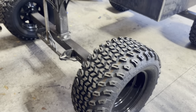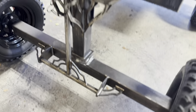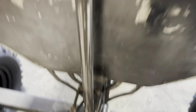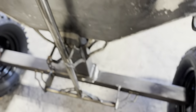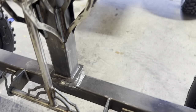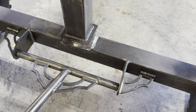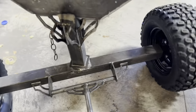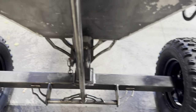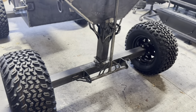Let's take a look at the front end and the wagon tow. Keep in mind this stuff is a little rough right now — it hasn't been cleaned up yet. It will all get cleaned up when it goes to paint and polished up. We make all this stuff in-house, including the wagon handle. The mechanism for steering is a 1,200-pound industrial turntable — basically a big lazy Susan. This thing will turn 180 degrees, and my wife can actually move this thing around as heavy as it is. On a hard surface, my wife can pull it around, so it makes moving this thing around very, very easy.